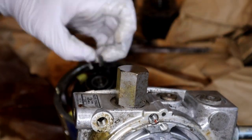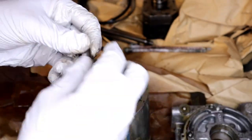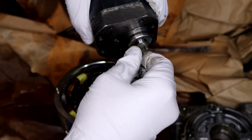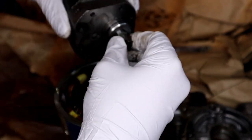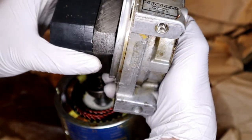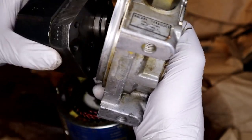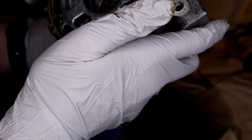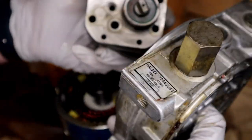There's a little connector right here — a vibration dampener maybe — and this inner piece is what interfaces with the pump. I don't know why you wouldn't just... maybe the shaft was a certain length and they needed to extend it. They put an o-ring on here and an o-ring on there to keep it from leaking, because this is going to be full of fluid. But then they only have one shaft seal — that's the only thing keeping the oil from getting out. Interesting.